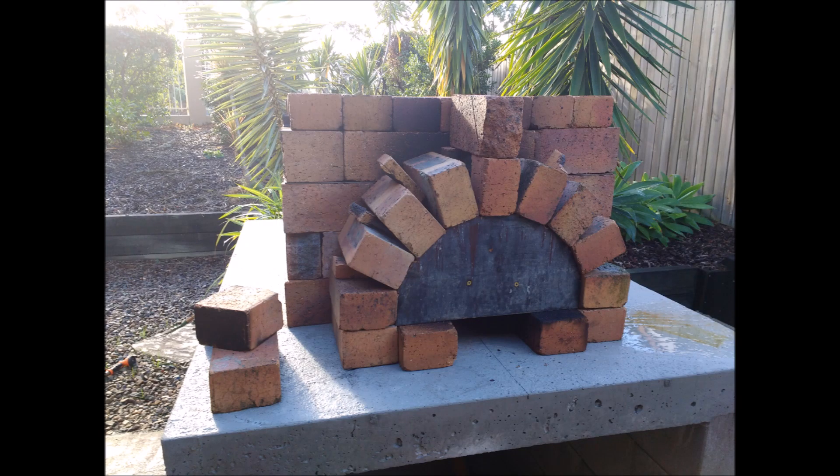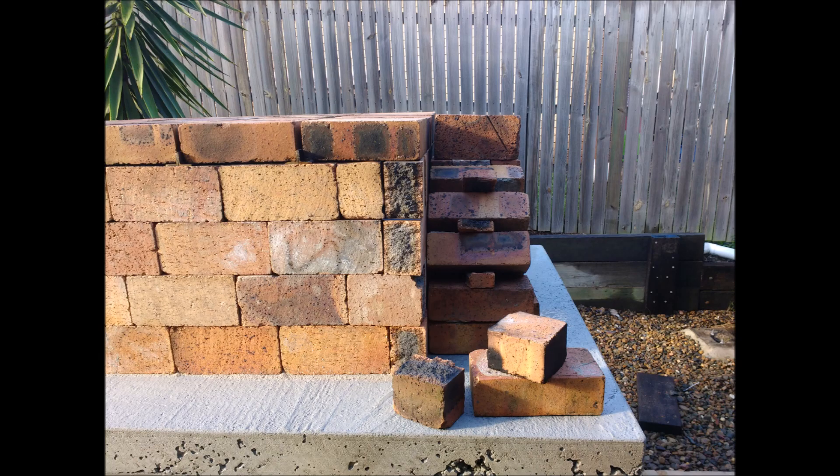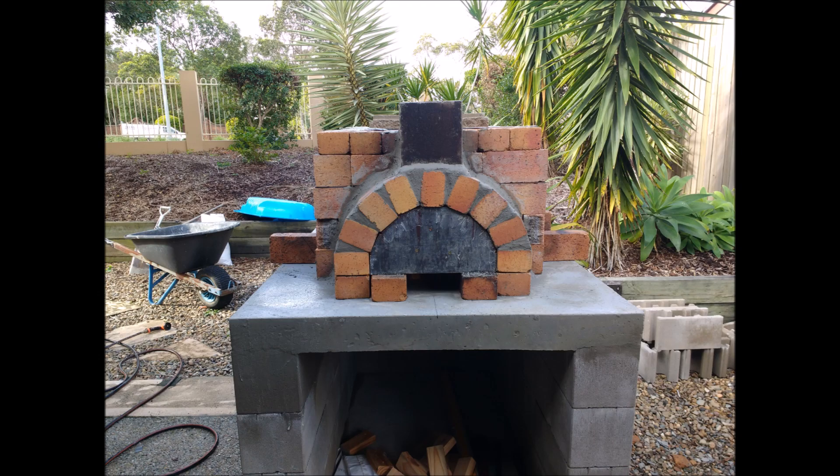It's a view from the inside looking up, and you can see the roof of the oven — just the steel beams. You don't want to use galvanized steel; it just needs to be black steel. Here's the archway getting set up with some spacers. I did mortar that just for looks, so I spent a little bit of time putting that together. But the rest of the oven doesn't have any mortar, so it does have little gaps in between where the bricks go, and you'll see in a minute how I deal with that.